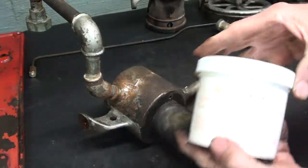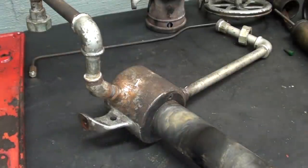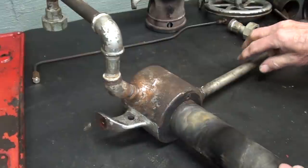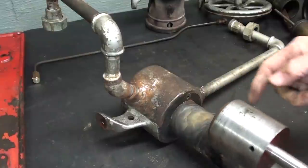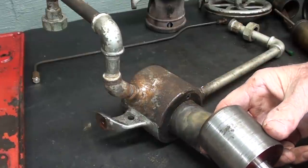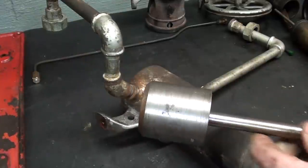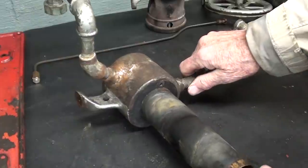I'll be using this flux — I've had that for 21 years already, probably used 1% of it. That white doesn't show up on the camera, which is why I have everything on a black background. I also considered whether I should put a plug in the area where I'm soldering, but then it would be very difficult to get it hot enough, because it would act as a heat sink. So I'm just going to be very careful and use my Prestolite acetylene torch. You cannot silver solder with Stay Silv using a propane torch — you have to have oxyacetylene, or just straight acetylene, like a plumber's torch.